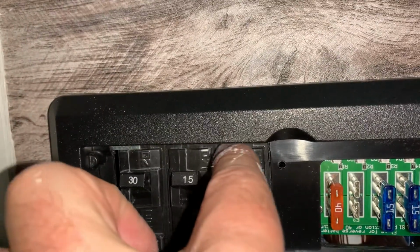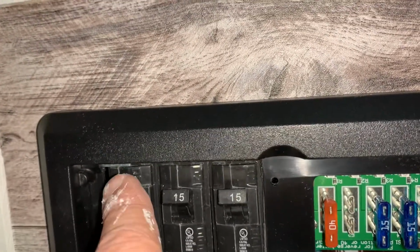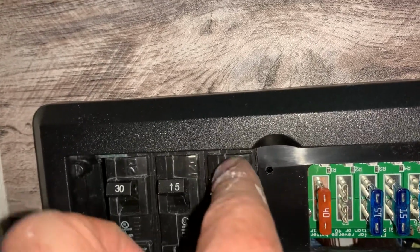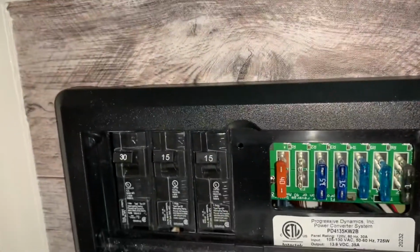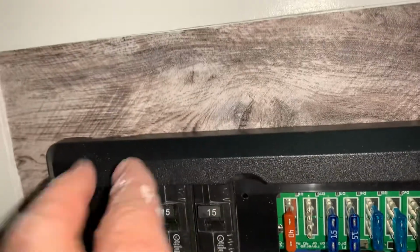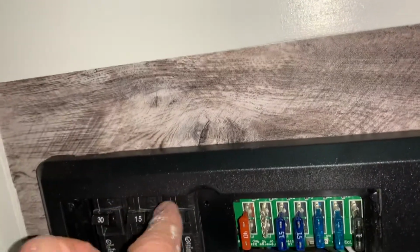up here there was like a 1/4 inch plastic coming down to cover the tops of the breakers. The problem is I think these breakers are proud of the zone that they're supposed to be in, like by 1/8 of an inch, so the plastic was interfering with the breakers, and so I couldn't click the cover into place over here. It was always hitting the breakers.